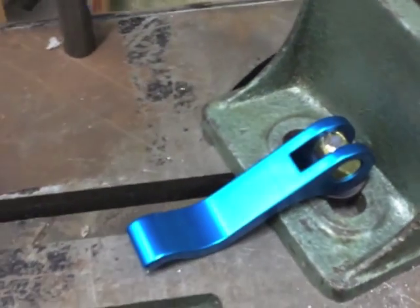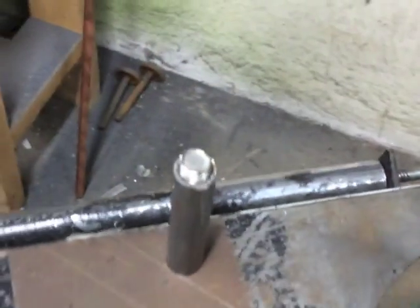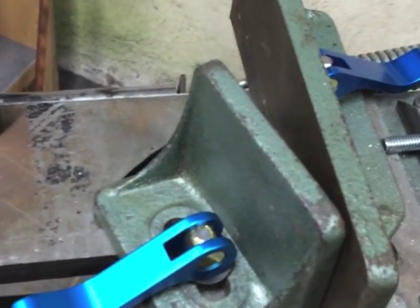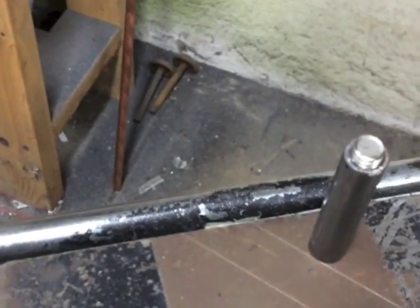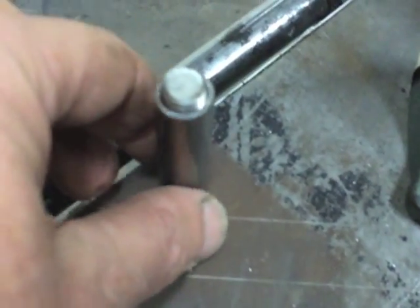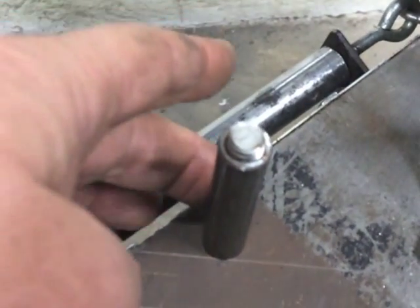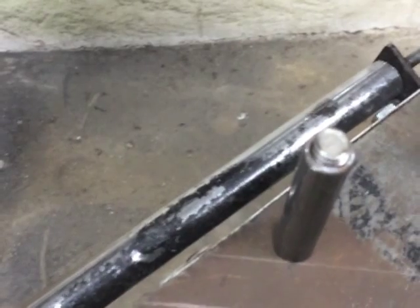I also love the idea of having a 45-degree point so I could put something against it and against the edge and get a 45-degree angle. But I didn't trust myself to drill and tap a hole in exactly the right place on one shot, so I got my micrometer and digital caliper out and placed the hole at half the diameter of the threaded rod and half the diameter of the sleeve — so that if adjustment was needed, I could get a thicker sleeve, weld a little onto it, or grind a little off. It came out really close — close enough for me.